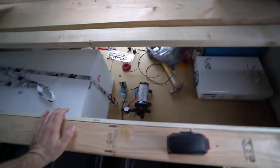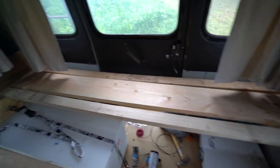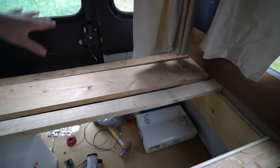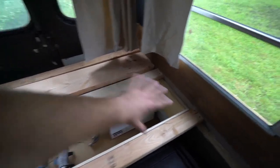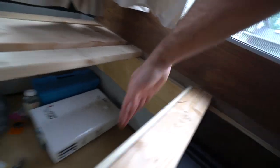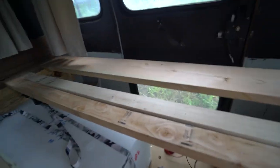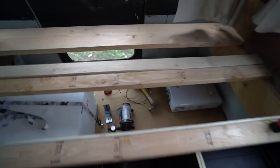I'm back from Lowe's. Look at the difference — two-by-four versus two-by-ten. The two-by-ten is nice and secure; the two-by-four is not. I'm going to drill this one in permanently on the edge for stability, and temporarily place the other two so I can work around it tomorrow. I want to put the inlet right here so it has a nice easy shot to that spot. There will be a little flex, but it's basically a two-by-eight instead of a two-by-four, and this is totally solid.